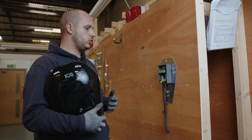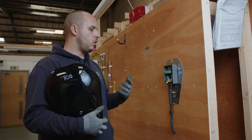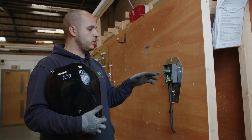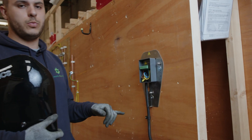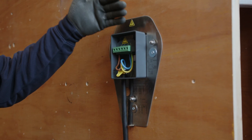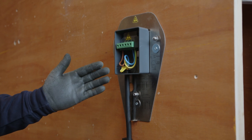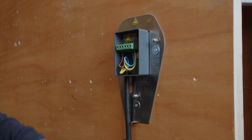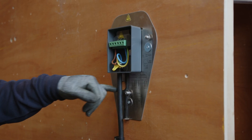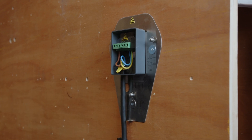Once you have removed the actual charging unit itself, you can see the backplate that was installed previously. This is a mocked-up dead rig in the workshop, but you can see from an installer's point of view that the actual charge unit mounts clearly onto this unit. The supply cable can be brought into the charger through various entry points — either from below or via rear entry as shown on the diagrams — and it also has pre-drilled areas to bring the cables into.